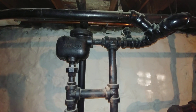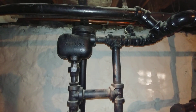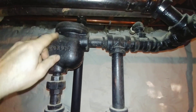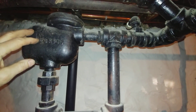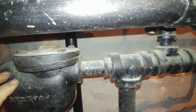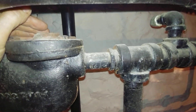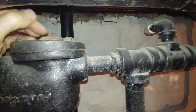I'm going to do a quick video on this 1920s Webster vapor system. This is what is called a float trap, and inside of here is a float which prevents the squirting out of water when the pressure got too high back in the coal era. On the top here, where my finger is, is the exit hole for the air — all of the air for the entire system has got to come out of here.